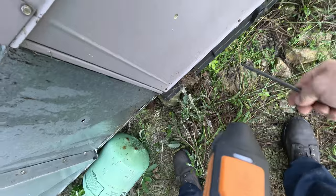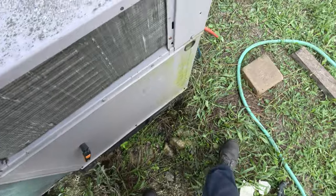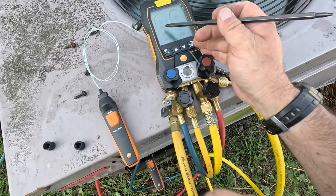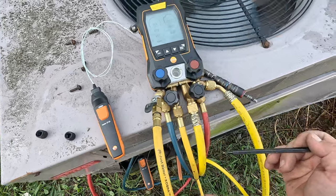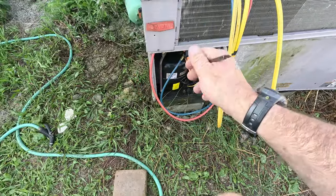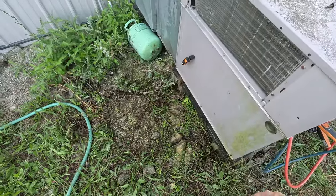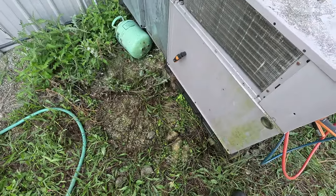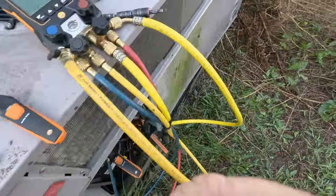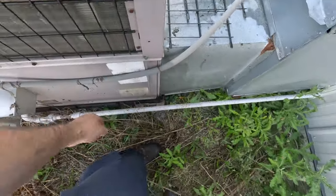I'll tell you this much — if you're going to complain about me drilling a hole through that, it's a whole lot worse for that compressor being flooded back like it's doing right now. We've got a 41.9-degree evaporator versus a 41.5-degree saturated temperature. We're actually coming back liquid. That's a whole lot worse than putting a stupid hole in the door. I'll put a piece of tape or silicone over it — not a big deal. So let's go ahead and get a supply temp also.